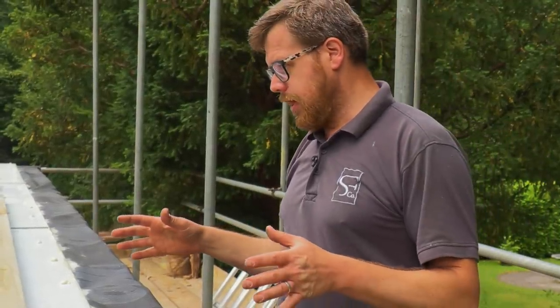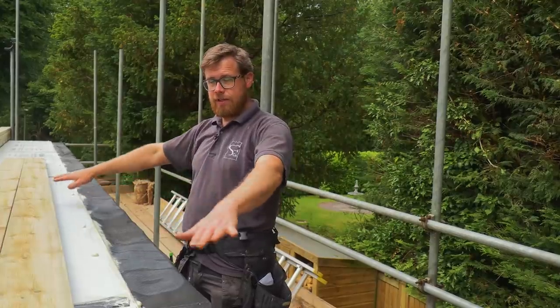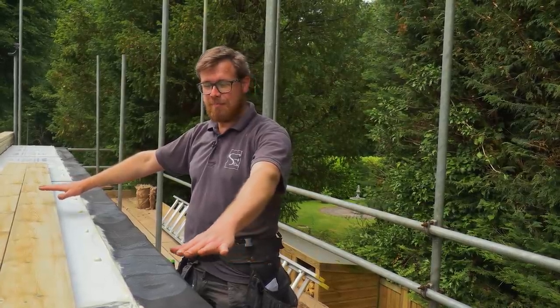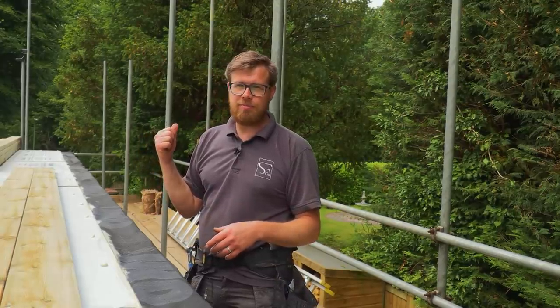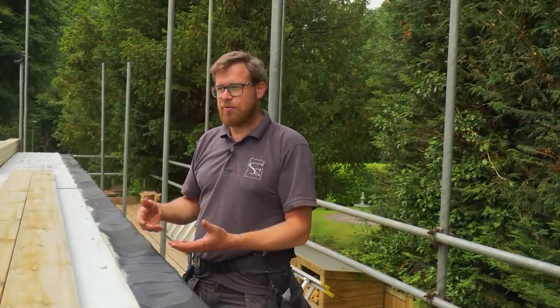What we've done up to this stage is stripped off the old parapet wall that went around. Underneath this there's actually a lead roof — it would have been lovely to strip that off and take it, but it wasn't economical enough. Lead prices are not great, and secondly, if we'd had a downpour it would have wrecked the lovely gym. There's the labour involved in stripping it, sheeting up every day. If we had a sudden downpour now we know we've got this great caber deck down.